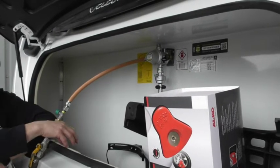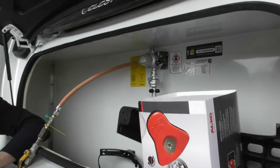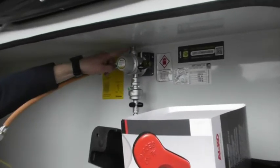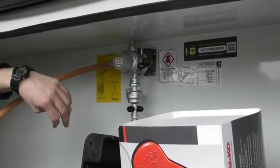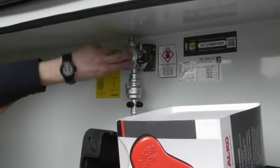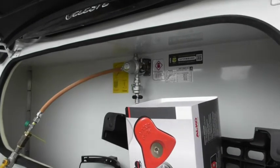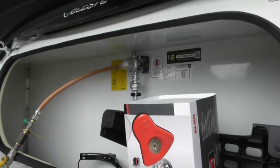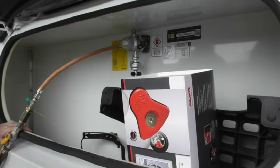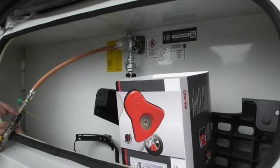So if you've got both running, this is that one, the one you will be using. That's your reserve. Every now and again, coming in and out of your gas locker, just check — see if it's still green. If it's gone to red, you're going to need to turn it across to the other one, even though it's still using it, just for you to recognise that this one is now empty and you need to change it. If you're only going to use the one side, just make sure the blank cap is on if you're not connected to another gas bottle. Or you can just use it as one open — once that's empty, turn that off, turn it across the other side, open that one up. So you don't have to disconnect and connect if you didn't want to.